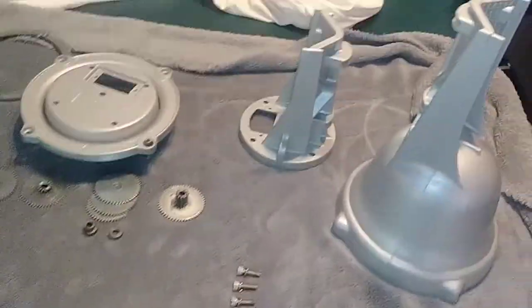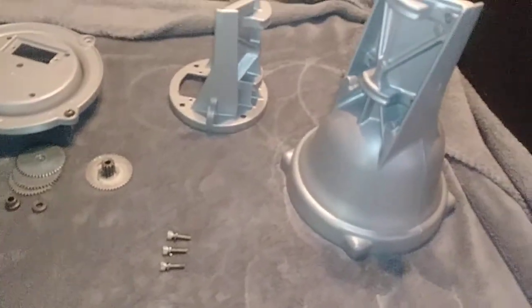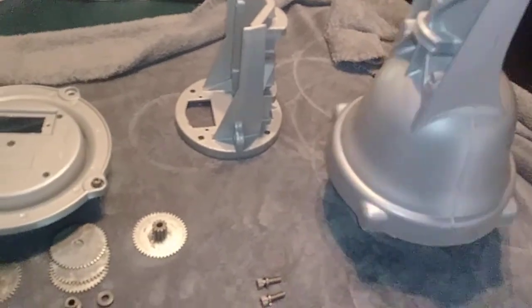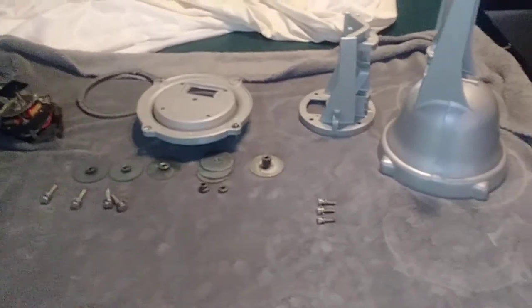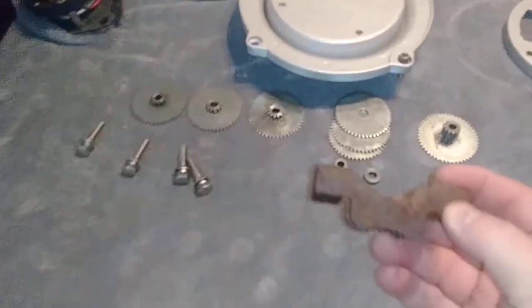But actually when you assemble it with the new bearing set, you turn it upside down and you stuff the bearings into that track and you build it upside down. And there's a potentiometer that rides in that groove that actually tells you north, south, east, and west as this shell or bell rotates. Pretty neat. Look up HAM 4, H-A-M, Roman numeral 4, and you could see it in operation. Give you an idea what this looked like.